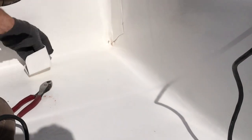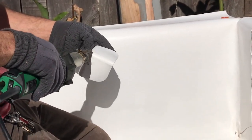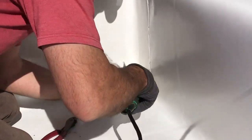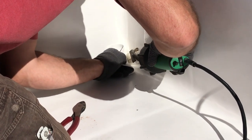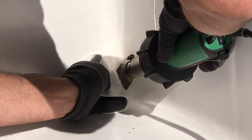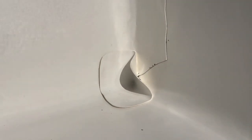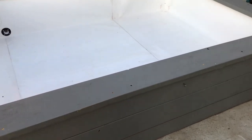That's what it looks like when it's done - the entire corner is sealed. Now we're doing the other corner. He's using the heat gun to heat up the PVC plastic, heating the area in the corner where he's going to push it against. It's kind of an art form - you have to know exactly when to pull away, when that plastic is hot enough without burning a hole straight through the membrane.